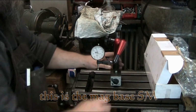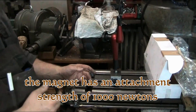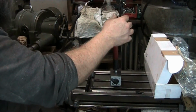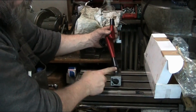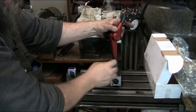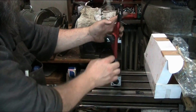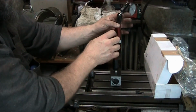This is the 280 millimeter model, so at full extension, it is 280 millimeters. Now we have, let's see, 1, 2, 3, 4, 5 axes of movement here. So you have down here in the base a pivot, and then of course you have the slot here to where you can bring it down like that, and then it rotates on its own axis here as well. If I were to rotate it like that, you can see there's still some movement there. And of course this one up here, and then again the same thing is down here. You have an axis turn here, a ball joint up here.